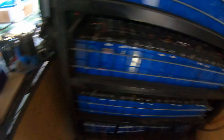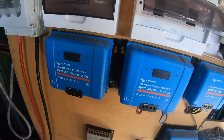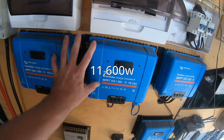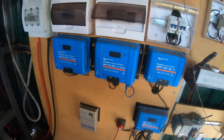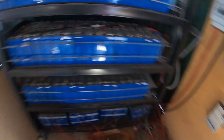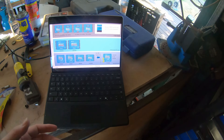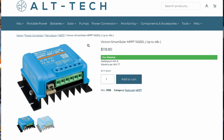So you might be going, why don't you just buy the 450/200? It simply comes down to budget. These are way cheaper — I was able to get two of these and effectively get 5.8 kilowatts each, so close to 12 kilowatts, for like two-thirds of the cost of the 450/200. If I was to rank these in order of cost-effectiveness, it's easily the 100/20. When it comes to bang for buck, they're like $110, and you get 1,200 watts worth of charging power — one of these large units is like $1,700 Australian.